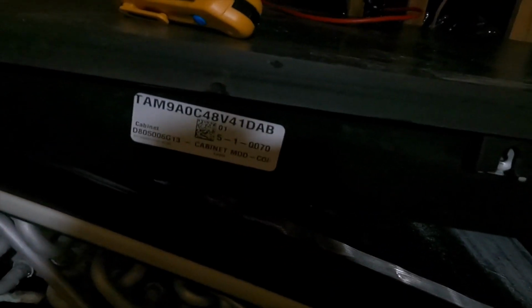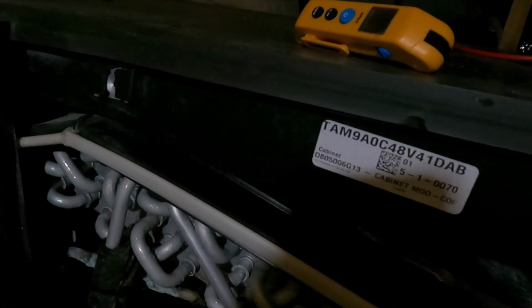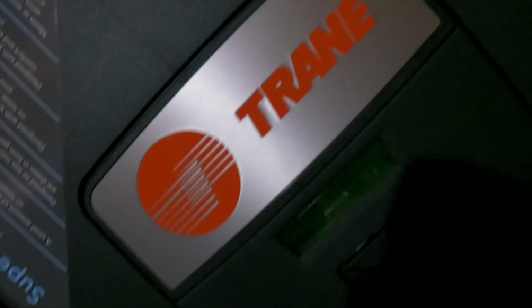We're gonna coat this good. It's more of a deodorizer. It's also a growth inhibitor. So we're kind of disinfecting the coil, so to speak. This is not a lot of buildup on the coil, so I'm not too concerned with it. But we want to get all the parts of the coil that we can possibly reach nice and caked. I like to get these areas too, simply to keep some growth off there. We got our fan coming back on, so I'm going to go ahead and disable that one more time.